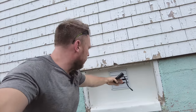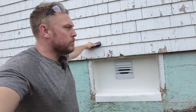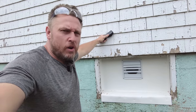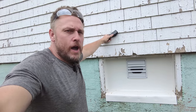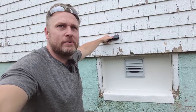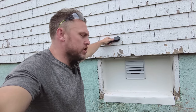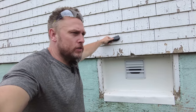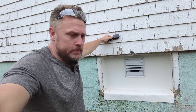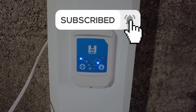Let's go outside and see what's going on with that vent. Look at that — it's working! I can really feel that, it's quite powerful. That's running at full power — it's kind of noisy, although once we've got the floor insulated in the basement, we shouldn't hear too much of that upstairs. I think most of the time, once we've got all of this initial moisture out, we'll probably run it on half power — should be half the noise. But yeah, it seems to be working. We won't know for maybe a week or so if it's truly effective. We've got to give it a chance, make sure the basement's fully sealed off with no doors open. Then hopefully we'll be able to come back in a week and have a relatively dry basement. Well, I hope you guys enjoyed this video — and if you want to know if this thing actually worked, be sure to subscribe and hit that like button.